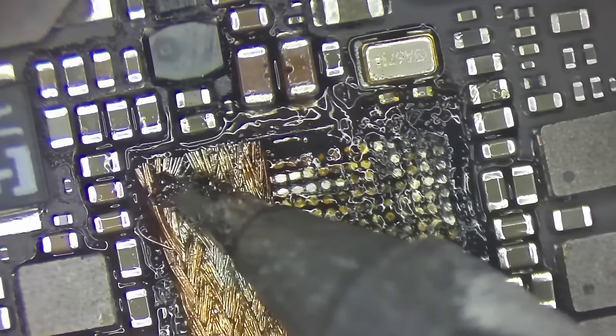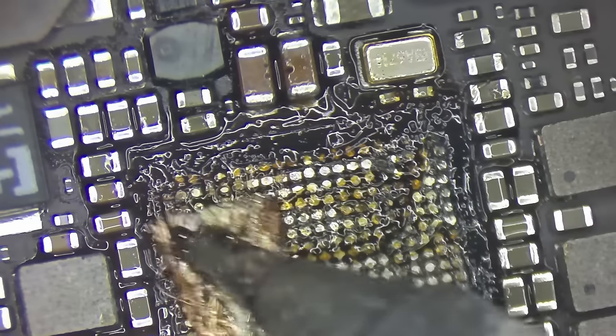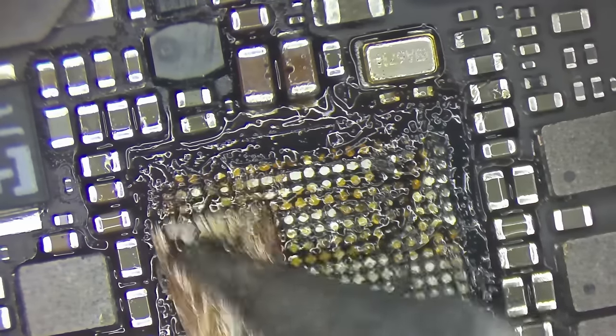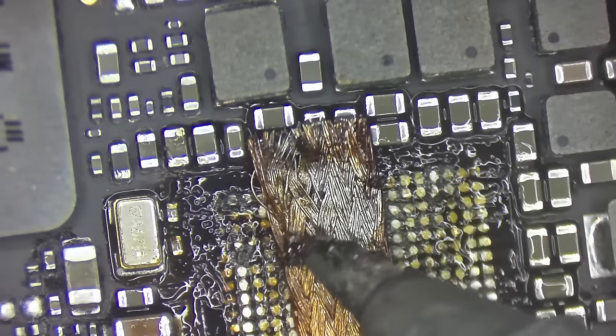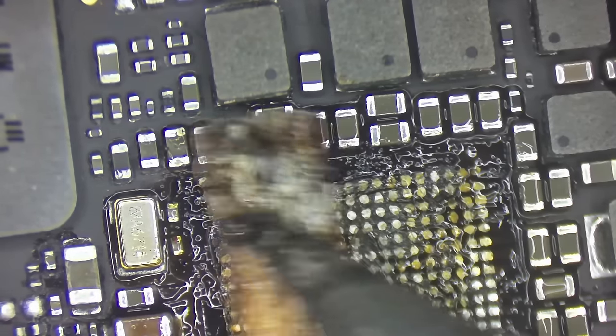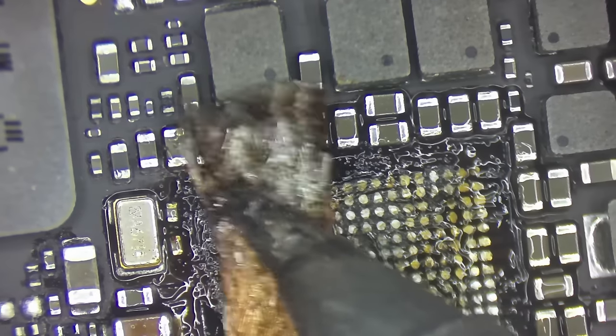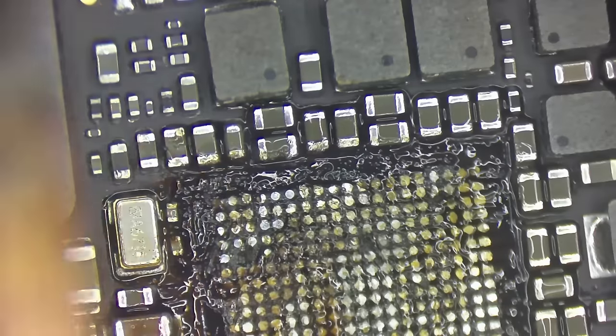Yeah, in my early days of microsoldering, I would have never tackled something like this. This just would have been a complete nightmare. One of the biggest things to remember is to just remain calm. This stuff really does work after it's all cleaned up and put back on. I'm doing this with CPUs quite literally several times a week now, if not more. And you just gotta clean it up, make it pretty, make sure there's no high spots along the edges of here.